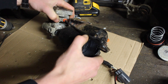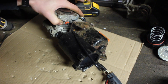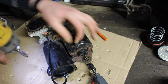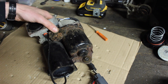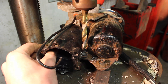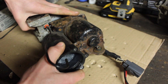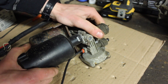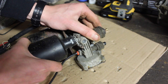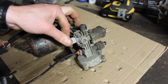The housing of the air dryer is held on by one Phillips screw and then you can rotate the whole housing and pull it off. The screw looks rather rusty in this case and I've stripped the head off it, so I'm going to have to drill it out. With the screw drilled out, I can now twist the housing and pull it off the motor.